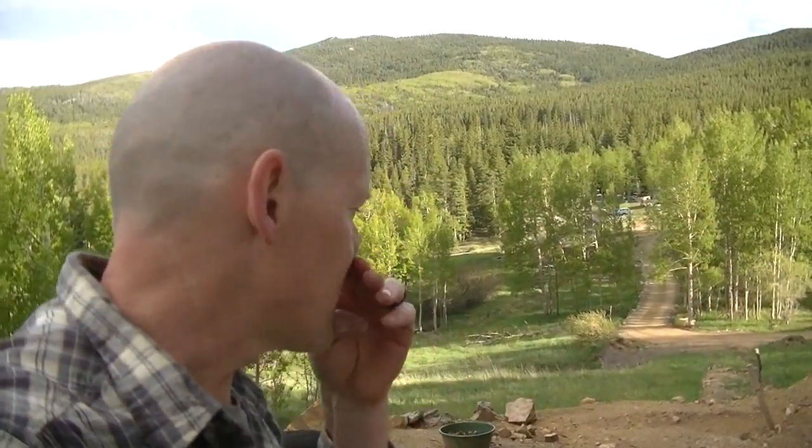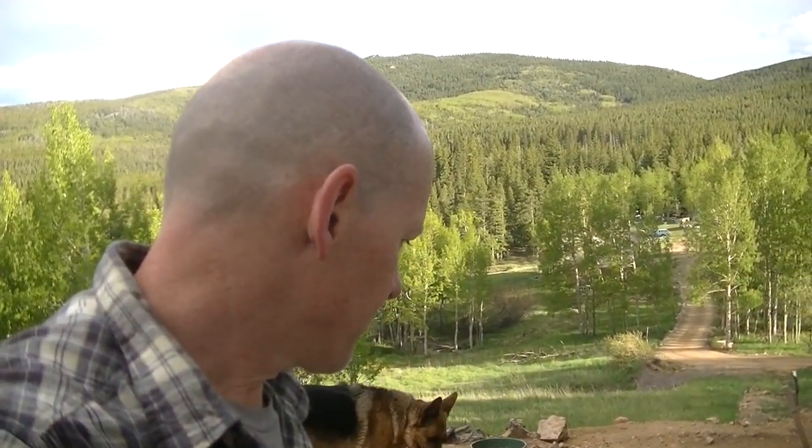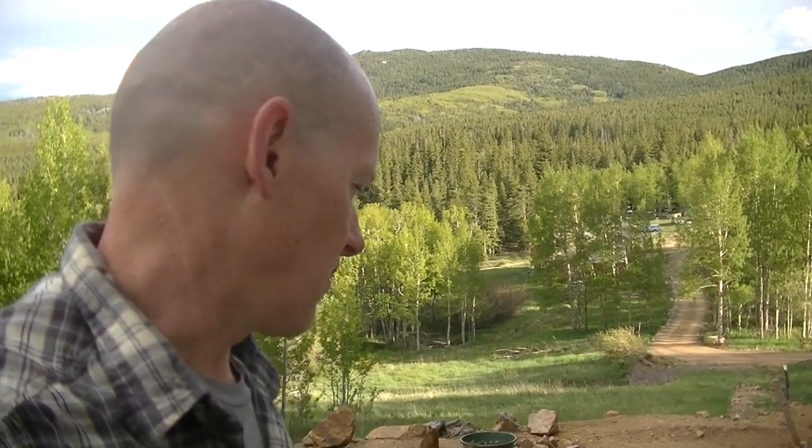The other thing that happens is you start to uncover some more air pockets. And so we might have to go back through with a slurry and kind of fill those in before we put the epoxy on there. And this hopefully should adequately clean the concrete as well, because there was wax in the mold. So I want to make sure there's no wax on it before we do the acid staining. Otherwise it's not going to work very well.